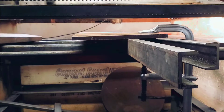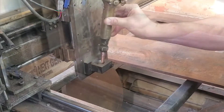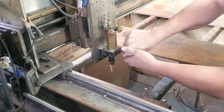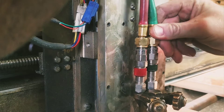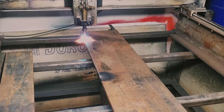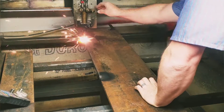It's just going to be a matter of cutting a couple of U-shapes in. I'm going to have to overhang this material when I cut it so I don't cut through the table, and I'm also going to have to clean the tip. If you've seen the video where I cut out the storm drain, there was a lot of popping going on because the tip was too close. This video was actually recorded before that, so I haven't adjusted the height — you're going to notice the tip on this popping quite a bit because the tip's way too close.